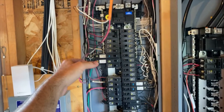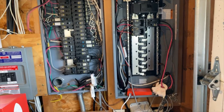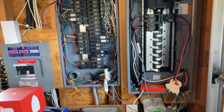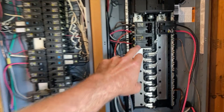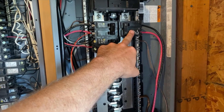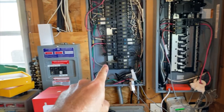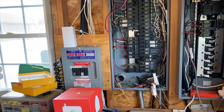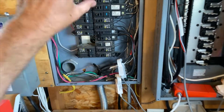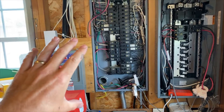You can see this wire dangling here — I'm just toying around trying to figure out if I can run the whole house air conditioner off the grid. I can, but it's difficult. So yeah, this is the whole house air conditioning system, this is my electric car charger, and this is the output from my inverter to the grid to feed the grid with solar power. This panel here has all of my loads — this line coming from the inverter was feeding all of my loads. My inverter would send power through those cables and energize all these circuit breakers and power the entire house.